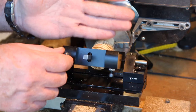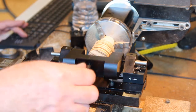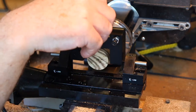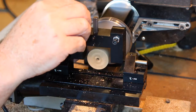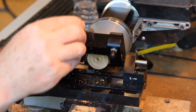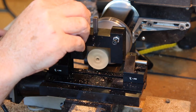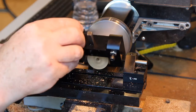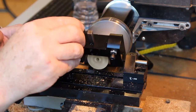So you just want to bring it up until it's vertical, then come down again, advance it, and keep going. I also find that it's best to start on top and work my way down rather than coming up. I'm just taking the corner off the piece, then advancing ten thousandths toward the headstock and doing it again, continuing this process until we have a hemisphere.